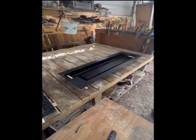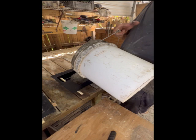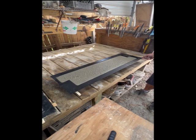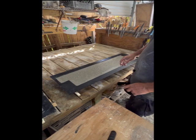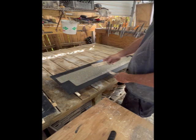This is how we pour the bed block mold. I've already got it oiled up and sprayed out with water. We want to grab it from the block corner here and the block corner here. We're just shaking it to level it out and get the air bubbles out. If you find your table is unlevel, it's important to pour it level — otherwise it's gonna be thin on one side and thicker on the other. If you run across that case, just get some wood shims and shim it up to eyeball level.